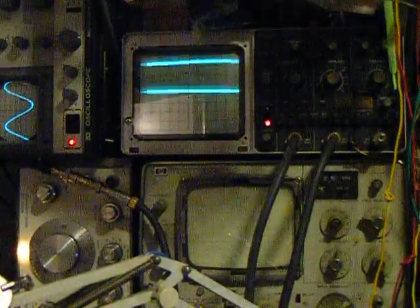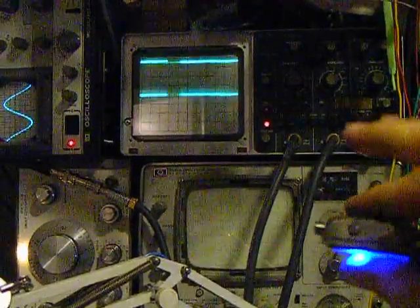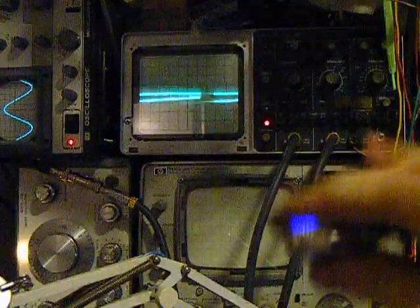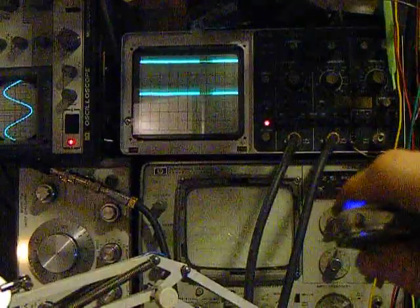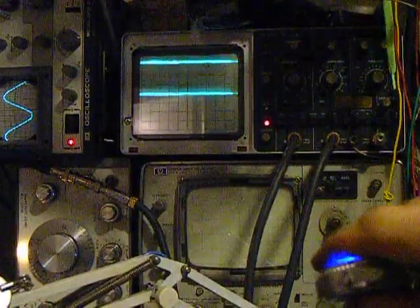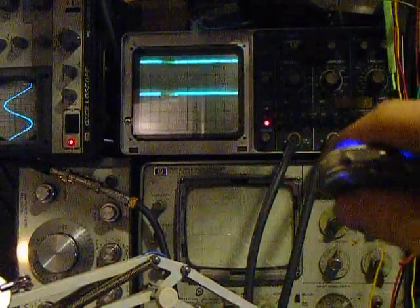The electronics on the board are tuned to chop everything out above about 200 to 250 Hz, because I'm interested in the 2 or 3 to 200 Hz range, because what I'm listening to is muscles. The concept is it's like a mechanical electromyography sensor — it's an acoustic myography sensor.